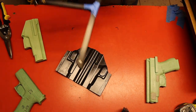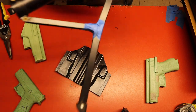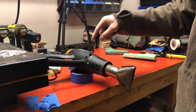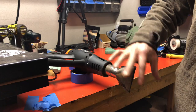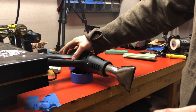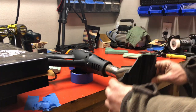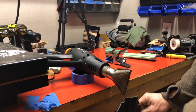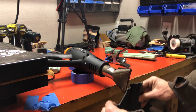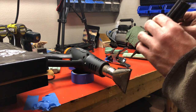As I was setting up my other camera, I realized my tripod broke — but hey, I fixed it. Tape can fix anything. We're going to take our heat gun here with the duck bill, because we want that heat to be dispersed at a point. What we're going to do is heat up here, probably 30 or so passes. I want to get to the point where I can flex it. We're right about there, I'll give it a few more passes.